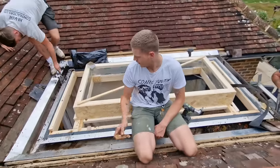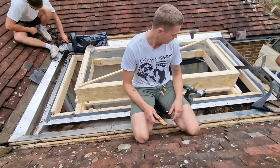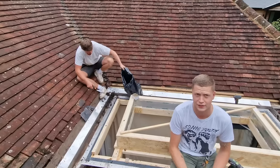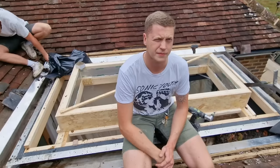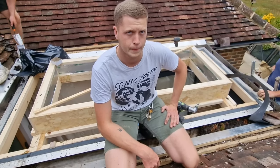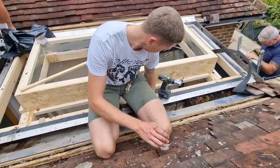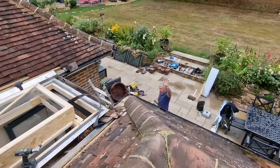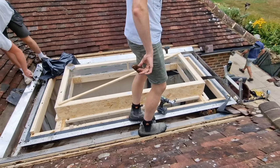We've stripped the roof light off now and cleared some tiles. We're keeping this lovely aluminium gutter — it's really strong and it's helping our structure massively. We're cleaning out the existing gutters that were failing — we've got a bag full of leaves and debris already and that's only halfway around. So we'll clear that out and start again. We're going to put our furrings on, lay our OSB down, and the boys are going to membrane over that. The OSB will come up and shoot over the gutter, and the membrane will come up under the tiles so it's completely accessible, serviceable, and maintainable. The gutter is thermally broken, beautifully solid — we've lined it with our frame and got our upstand on. Simon is here — he's the Alwitra king — and with Tommy the Alwitra prince they're going to crack on and do it.